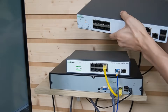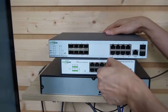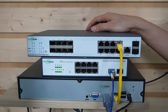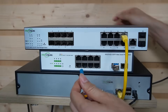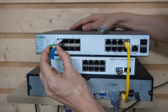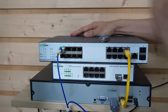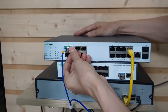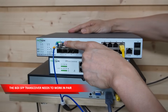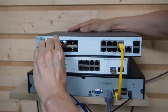Now let's make the changes. First, I'm going to power up this core switch, then switch the network video recorder connection over to the core switch. We also need to remove the fiber optic strand from the PoE switch and connect it to the core switch — we need to install an SFP transceiver first. Let's pick one of these SFP slots and connect the SFP transceiver. Then I'll install the second SFP transceiver — I think I just made a mistake. You see the colors are different; these are BiDi transceivers that use different wavelengths, so they need to work in pairs. The one on the other side is blue, so I need to connect the green one here — that's the correct pairing.